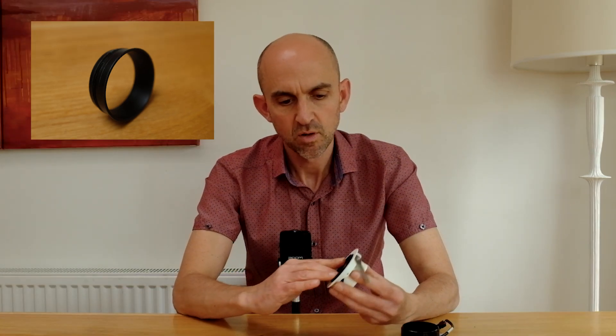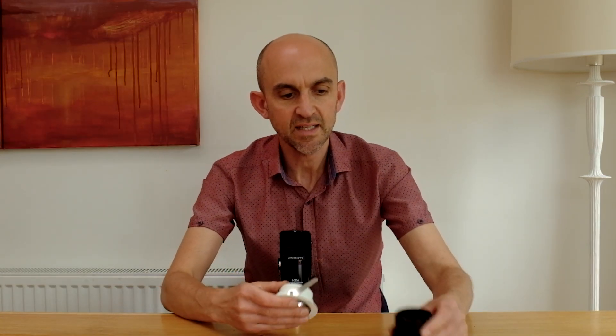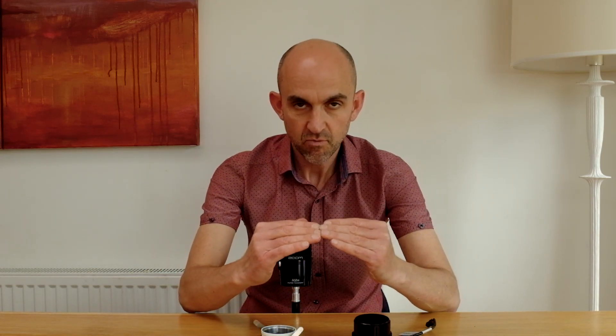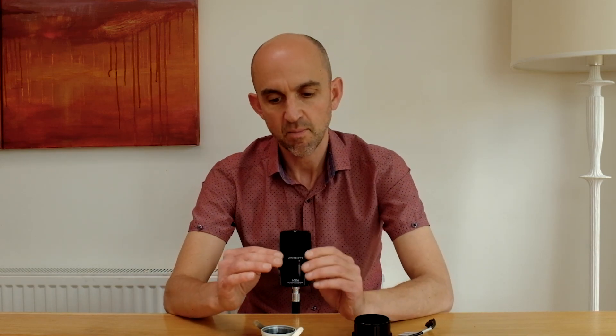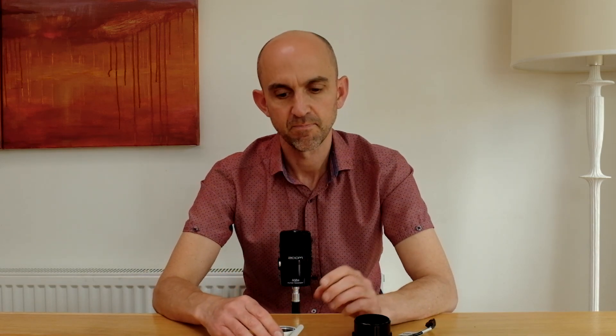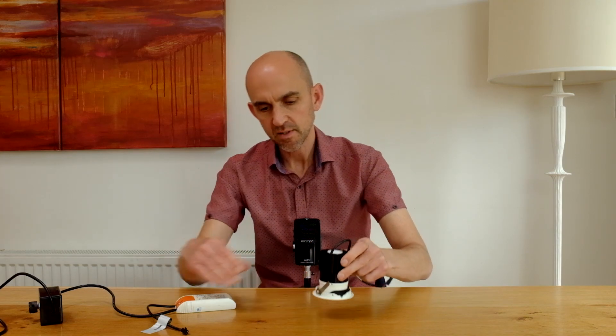There's a baffle on this product because we want the LED chip itself as deep within the fitting as possible. By doing so, we are maximizing the protection we can give to the user from actually seeing the source itself, so it's a better form of glare protection. It is powered externally with a driver.